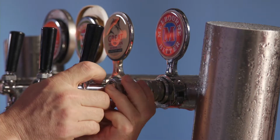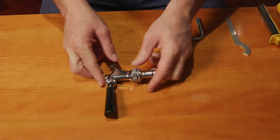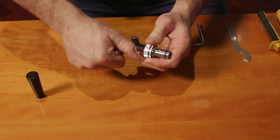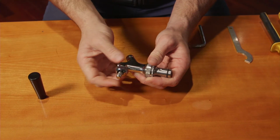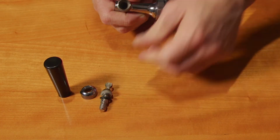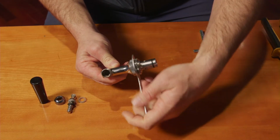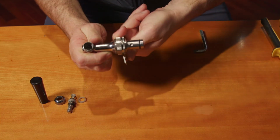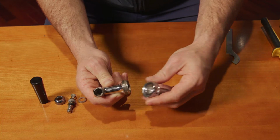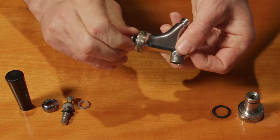Firstly, remove the tap from the adapter or font, then rinse well with water. Unscrew your handle from assembly and remove the bonnet nut. And now pull the complete handle assembly away from the tap. Using your tool, loosen the coupling nut and unscrew clockwise. This will remove the adapter from the tap. Take out the tap shank. Push out from front to back the top valve shaft.